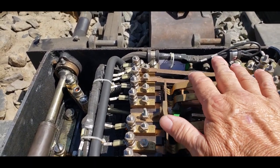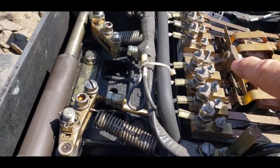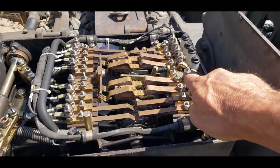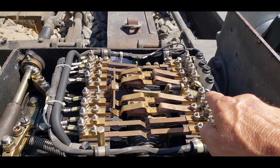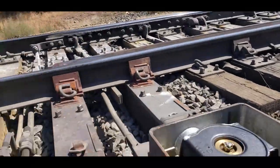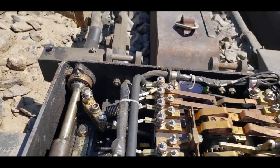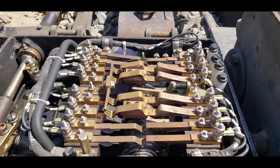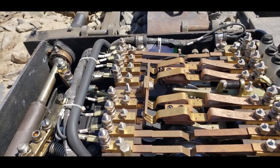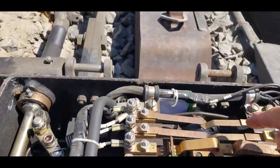These are the normal contacts right here. For the normal indication, these are the reverse contacts. You can see these contacts are down against the contacts, so it makes a circuit through there. And that tells the control apparatus in that house that this switch is reversed. The set of normal contacts over here are up, and this one is shunted against the bar, so there is no way you can get any continuity through that set of contacts. That keeps the normal switch repeater in the house down.